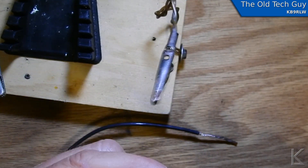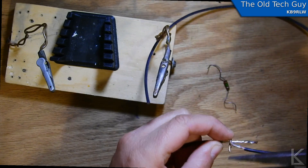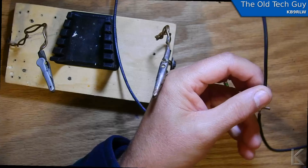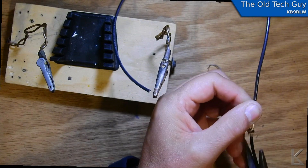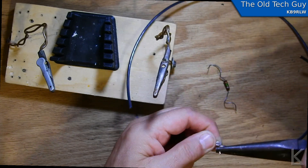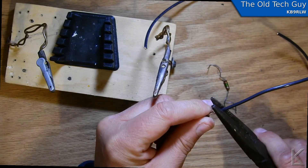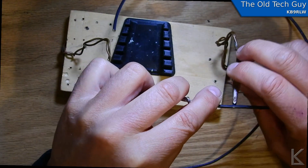And then I can do the same thing that I did before — put a bend in it. It's easier with smaller wires; I'm using heavier gauge stuff like you'd use for an antenna, so that's why I'm using the pliers. Then this side — bend in there, take it around the other wire. Again, I'm just doing this once around. You'd want to strip back about two inches of wire so that you have a couple of wraps, but we're just doing this for demonstration here. And then we'll just solder it.